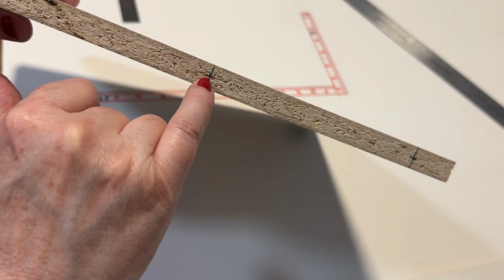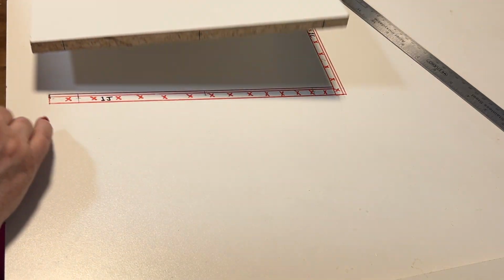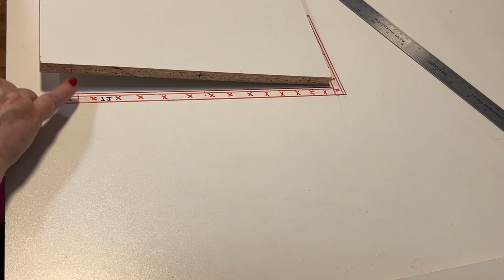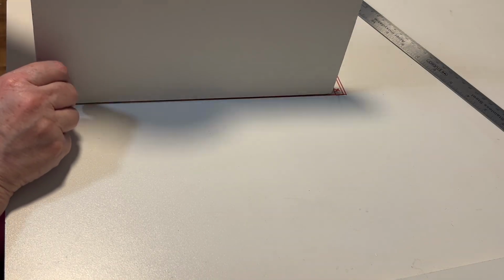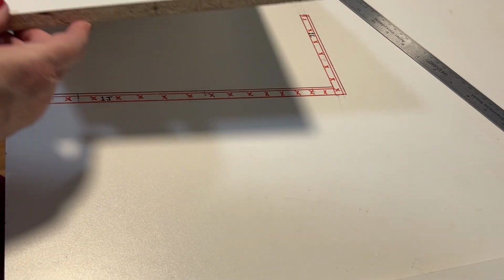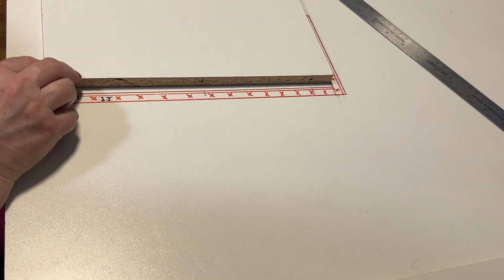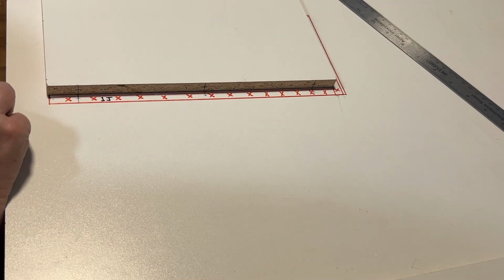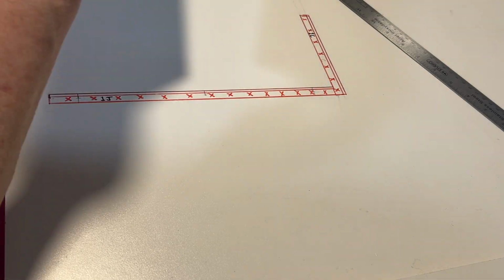I've measured out the halfway point on the width of the wood. This is a really important measurement. If you drill your holes exactly in the center of the width on the wall as well as on the floor, you shouldn't have any trouble with your dowels lining up. Now, as for how far apart your dowels are on the length, it's really not as important.